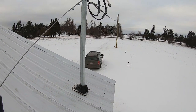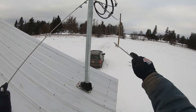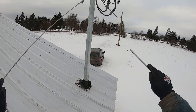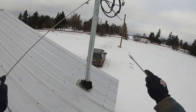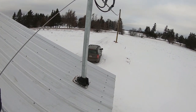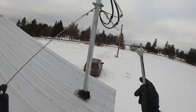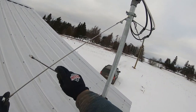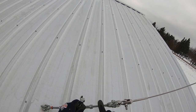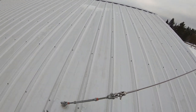Especially given the concerns that I have with high winds and freezing rain. When that happens, these conductors start collecting ice — a little bit forms around them almost like a big sausage — and then as more rain comes along, more ice builds up and it can get quite heavy. We're expecting winds in excess of 90 kilometers an hour, so when you mix those two things together you put a tremendous amount of strain on these service masts. We'll just tighten down these nuts here to prevent the turnbuckle from loosening due to vibration.